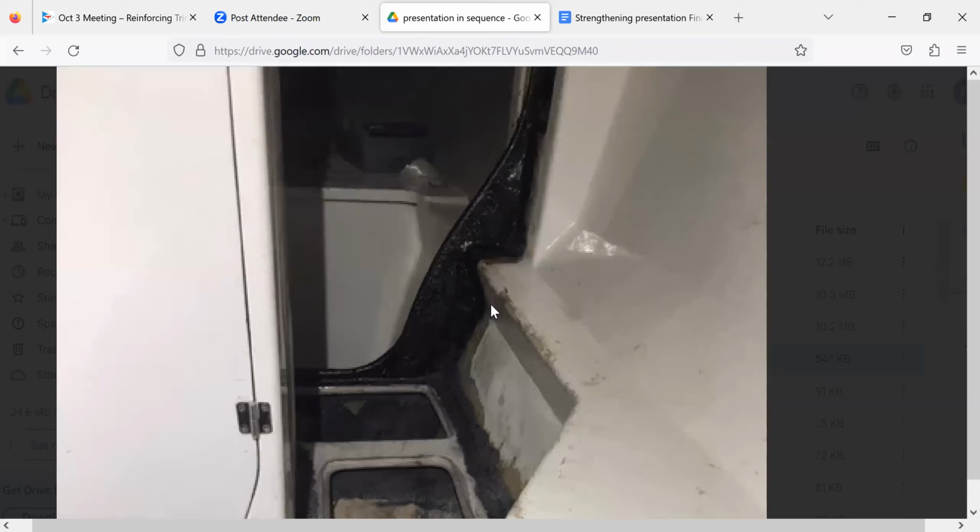Earlier, when I bought the boat, I extended these stringers, because these boats, if they don't have stringers, the hull flexes quite a bit. But this boat's very rigid. So that's one thing I would say: don't hesitate to fill up that passageway with as much structure as you feel like. Put stringers all the way through it. Having that big cutout just really reduces the rigidity of the boat. So I think the fact that you got those things in the battery box, the filling in the passageway, the stringer, all of that is helpful to strengthen up the boat.